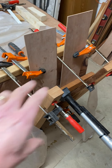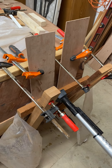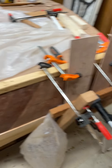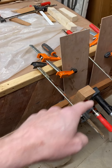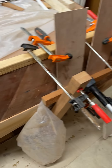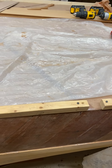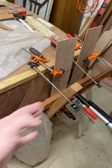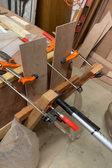This is probably the most complicated clamping I've had to do — these pieces back here toward the back. They're just about less than a foot and a half long, the way it worked out: a long piece, then a real long one, and just this short one for this part. The row below had a piece maybe six or so feet long and I did similar clamping, but I had to do more of it because the piece is longer. You only have to do this extra clamping over about four to five feet of the hull from the rear.